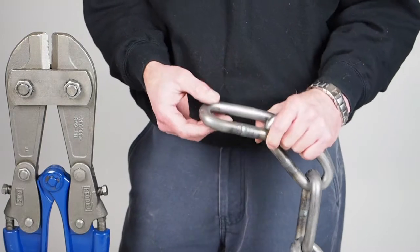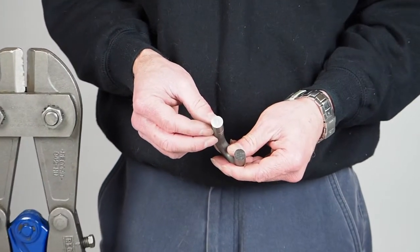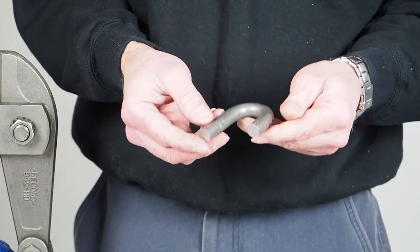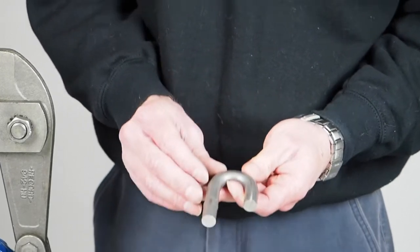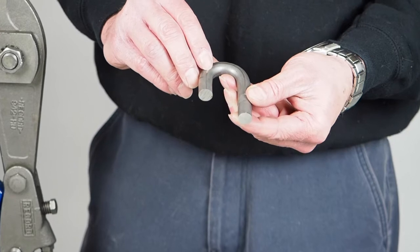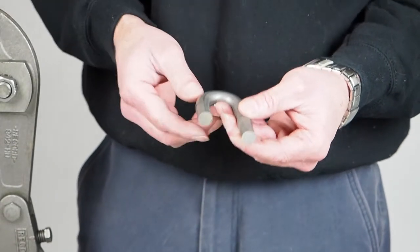Now some chains are case hardened and some chains are through hardened. This is a reflection of the hardness profile across the cross section of the material — as you go deeper into the steel, the hardness can vary. This is a piece of 13mm that's been through a lab test. The surface has been polished and there are a couple of very small indentations where the hardness testing machine has been used to get a reading for the surface hardness — that's the hardness of the skin, the case on the material.